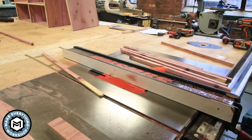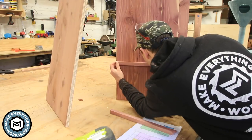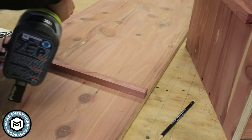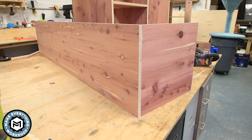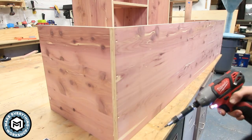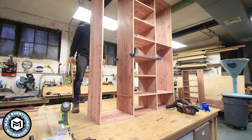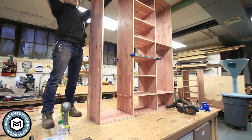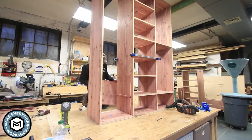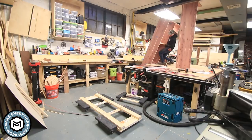I leave my nosings a little bit oversized so there's a small lip, then sand everything down for a nice finish. There's also a little shelf support that gets attached with glue and nails, with a mirrored version on the other side, so when the sideboard gets installed the shelf can sit on top and have nice support. I countersink and use screws anywhere they won't be seen. Once that section is done, I added the top shelves.